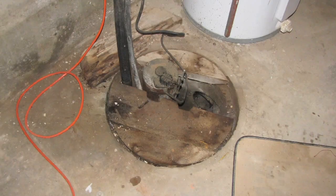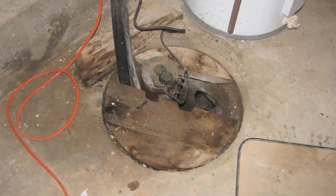So two three-inch pipes, one being CPVC. The unit is going to be propane — is there anything I need to be aware of there? No, it's pretty similar to natural gas. Power supply is just a 110V power supply. You should also have a drain for the unit. We have a sump pit here so I can drain into that.